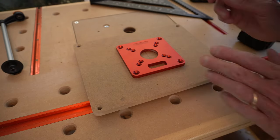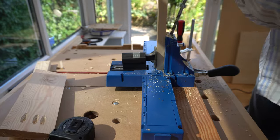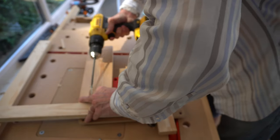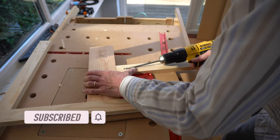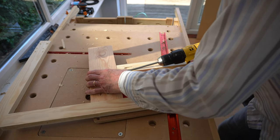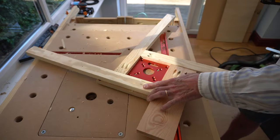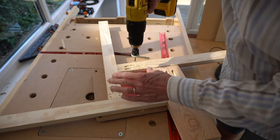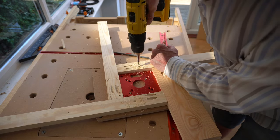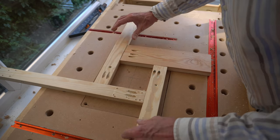The final plate is for my smaller Makita router. This aluminium plate I bought a while ago off Amazon and it's been kicking around the workshop for a while, so it was nice to finally use it. I found four pieces of scrap inch timber and put a couple of pocket hole screws in one end of each — this makes a cheap and cheerful routing jig so I can rout the recess in the face of the insert panel. I inserted a couple of screws into the face of the insert panel. Of course if this had been a finished piece of joinery I couldn't do that, but seeing it was just an insert panel it didn't really matter.